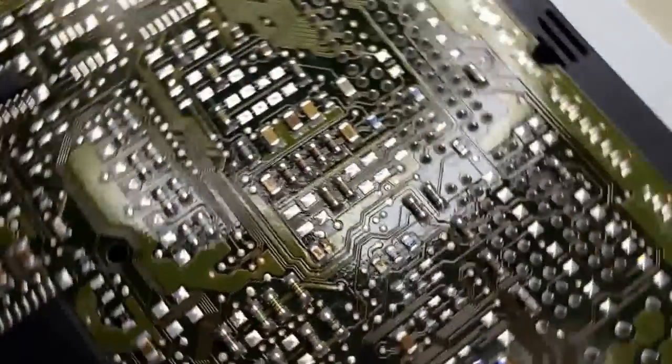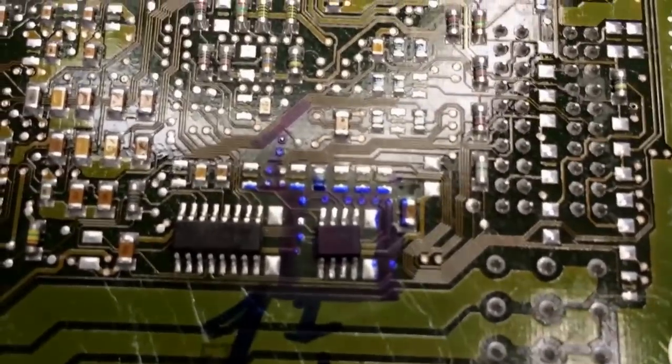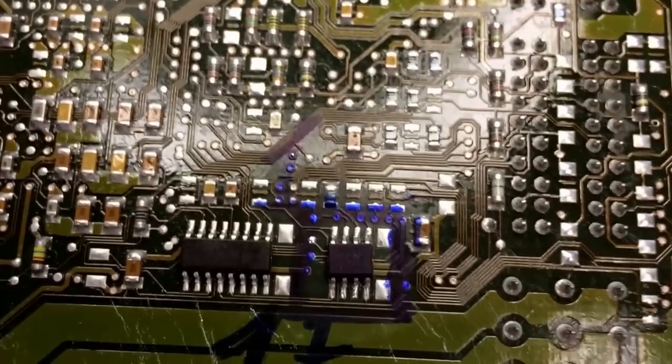Remove it, and then put the original chip on this one and solder it. Before you solder it, you gotta make sure you can read the numbers right — which is, I can read 30132, as I marked it here. I solder it back, put it all together, and your car will start.